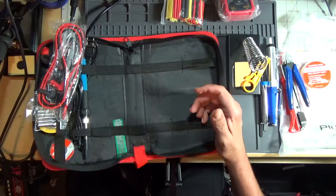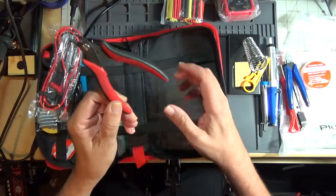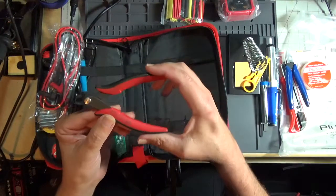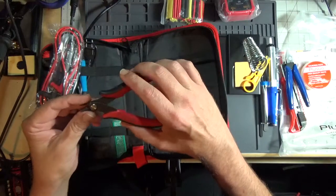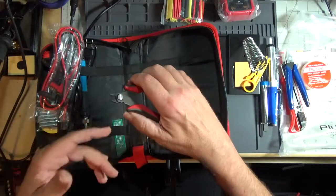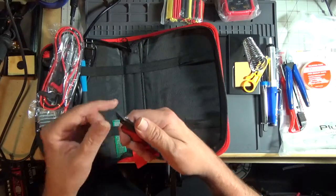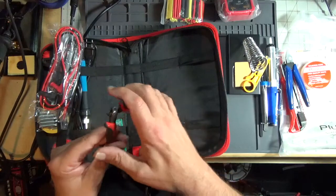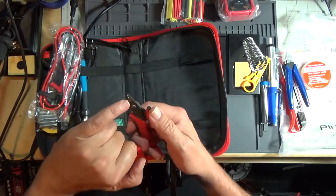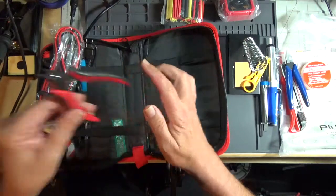Say these are CHP. They're distributed under the Hakko name. Well respected. You can buy 3 of these for less than $20, and you have one for general cutting and hacking and chopping up boards, and then 1 or 2 for the fine work where the jaws will stay sharp. But if you're doing general hacking, these here already have gaps in them because I've been chopping on boards.